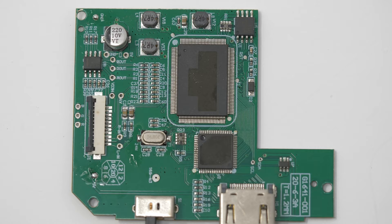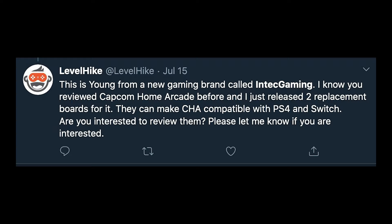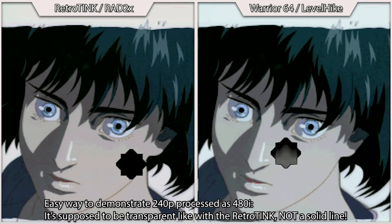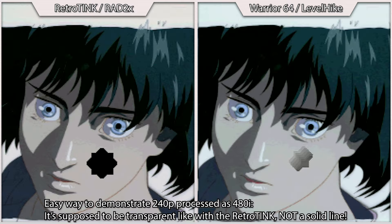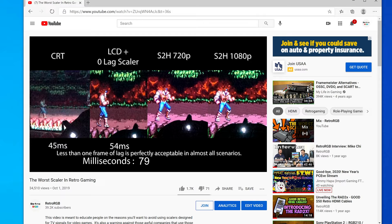Using the HDMI output should be perfectly safe, but I'm not sure if you'd want to. This HDMI board is the same exact garbage that's in the Pound, Hyperkin, X-Agent, and Levelhike cables — and it looks like this might even be the same group that operates under the name Levelhike. These cables scale the image to 720p, which looks nice on still images, but as soon as there's movement on screen, things get a shaky and blurry look. This is because the chips all of these companies use were designed for 480i TV signals, not 240p video game signals. The real issue is lag: all of these HDMI cables add a lot of variable lag to the output, and the variable part is the problem. Most TVs have around 1 frame of lag in game mode, and it's always 1 frame — people naturally adjust. If the lag is always changing, like with this kit, it's impossible to get used to.